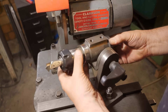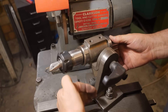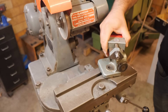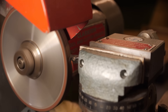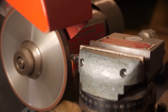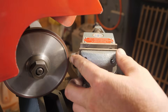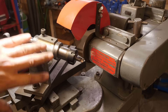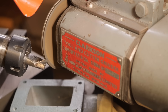My first idea for grinding the tool was to hold it in an ER collet chuck in the universal head, but there was too much length and I couldn't bring the table back far enough. We had to switch to a three-jaw chuck. Note: sorry about the audio here — I failed to push the microphone jack all the way home. We ground down the end of the tool, then swung the vice over for the first angle. For the second angle we tried various vice setups but couldn't get them to work, so we switched back to the universal tool holder and flipped the diamond cutting wheel around. That setup then worked fine.